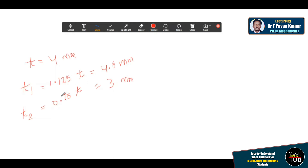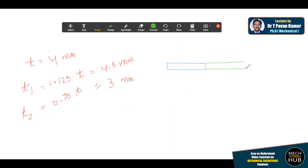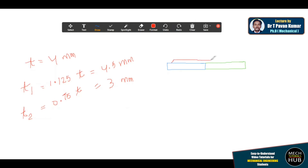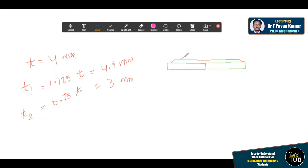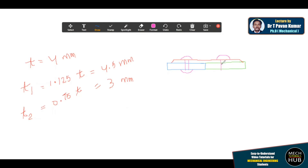The question is where exactly to use t1 and where to use t2. Consider sheet number 1 and sheet number 2 — this is called a butt joint. A strap is a thin sheet which helps to catch hold of these two sheets. For a single strap, I can place a rivet on one side and one to the other side of the butt. I drill a hole, place a rivet from top to bottom, and with a hydraulic or pneumatic press I get the snap head.